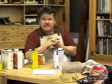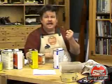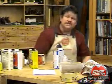If you've got a wood and the temperature and humidity is right for this to bleed, don't leave that wood. You're going to have to sit there and babysit the finish for a couple of hours and wipe it at least once an hour. Otherwise, you'll have runs and shiny spots in the finish that you didn't want.